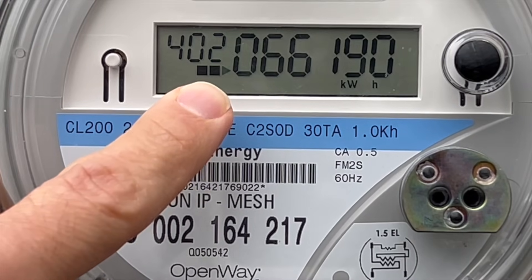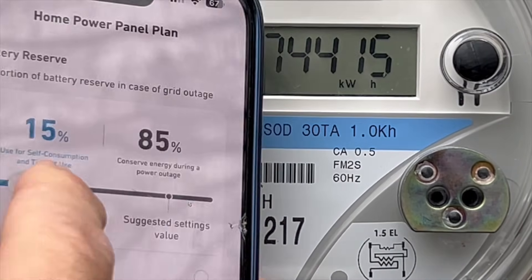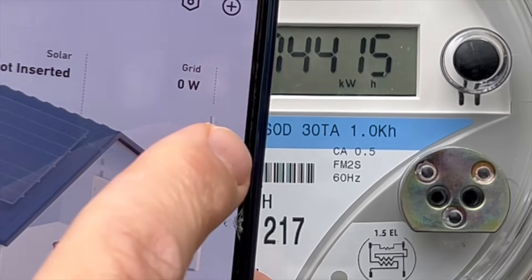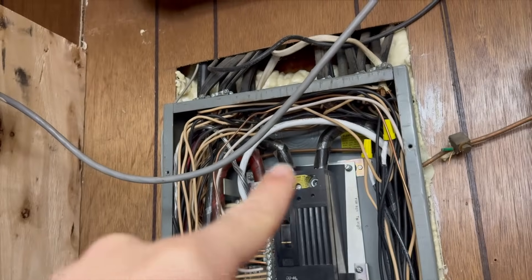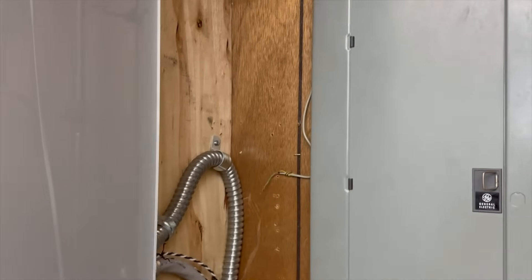If we go outside and look at my bidirectional utility meter, this is what it normally looks like — arrows moving to indicate current and its direction. Watch what happens when the home power panel is backfeeding only to my home's electrical panel: that icon movement stops altogether, so there's virtually no current passing through this meter. It uses those sensor clamps to measure current from the main supply lines. My best guess is that the home power panel runs an algorithm to keep that current at zero and supply the home loads with battery power. Because of this, it doesn't backfeed to the power company's line, so you won't get any credit on a bidirectional meter.